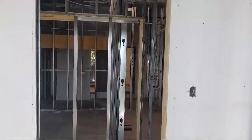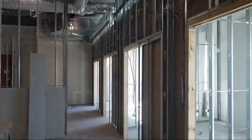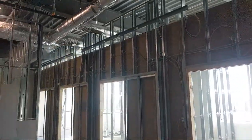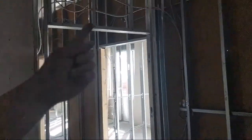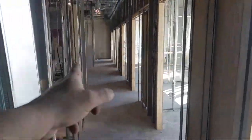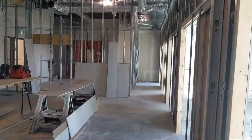I hate that. Going in and doing all the gravy first is just the wrong attitude. Get the garbage out of the way first, right? And always do the insides of your rooms. Get your floaters tied in, and then any room that needs to be insulated. This room here has to be insulated, but anyways, we're going on the inside in here because this other room needs to be insulated as well. But yeah, you should be aiming for 40 sheets a day. If you're by the hour, that's kind of what most companies will say too.